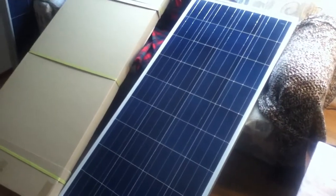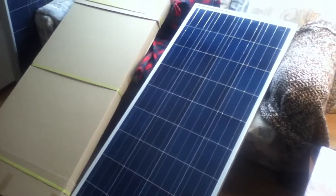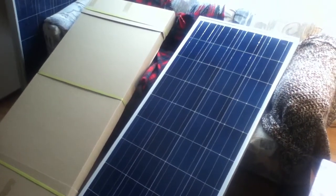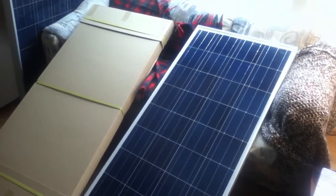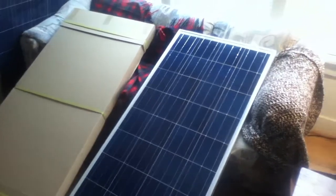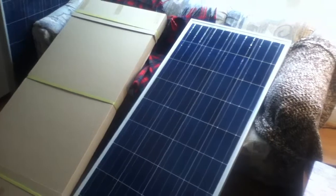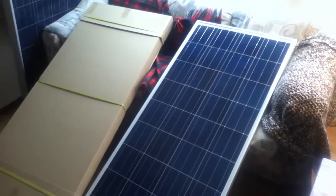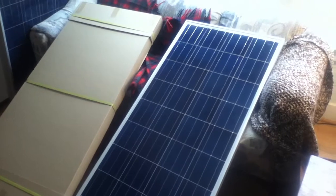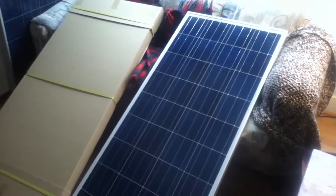With three 145 watt panels, we're going to be at roughly 435 watts worth of power. Even though a charge controller might say it's capable of doing 500 watts and 30 amps, we really want to call that 24 amps and 435 watts for a 500 watt charge controller. When the panels are brand new, they do overcharge a little bit, and that's why you can pop a charge controller — you can pop the circuits in bright sunlight with brand new panels if you haven't scaled that charge controller to be a little bit stronger than what your ratings and specifications say.